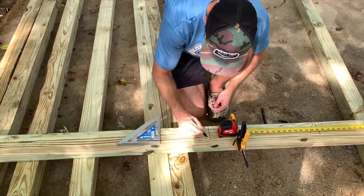Next up, we're going to install our GFCI outlet, and to do this, we're using one of these exterior rated outlet boxes. I'll link it in the description, and you're going to attach the mounting clips to both sides and fill any conduit openings that you're not going to use. In our case, we don't need the one in the middle since we're going to be going in through the top and out through the bottom.